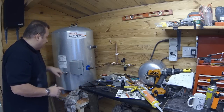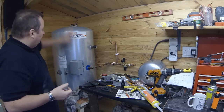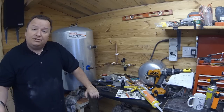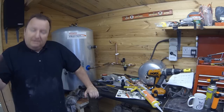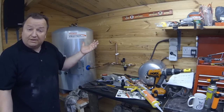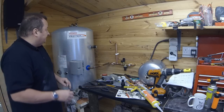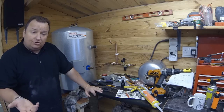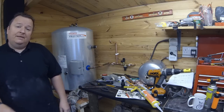The reason why I'm not going to have the coils fitted up - as I said initially, this is what I was going to do. If I need to fill the tank up from cold, I don't really want to have to use this because it takes about three or four of these to fill it up and that will take quite a while. So all I'll do - just across the way there, just outside, I've got my hot tub which is constantly at 38 degrees. All I need to do is get a pump and pump from the hot tub straight into there, and that will probably take about 10 minutes with an external pump. That will just fill the tank up, and then use this as a top-up. So that's the reason why I'm not going to actually install the hot water supply to this. This will only ever be used electrically - this is double insulated and very good for heating up electrically. We'll just use the electricity at night via the night rate, so we'll be using the night time electricity costs, which are a lot lower, and that will be heating up the tank. A good hot tank of water, this will probably last all day, bearing in mind you'll only be topping it up every now and again.